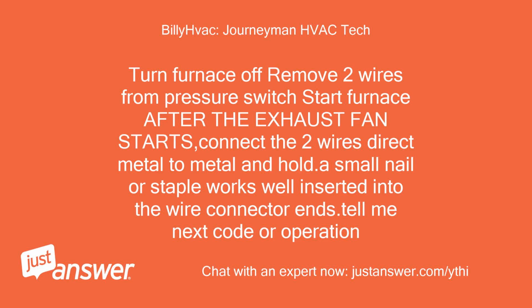Turn furnace off. Remove 2 wires from pressure switch. Start furnace after the exhaust fan starts. Connect the 2 wires direct metal to metal and hold. A small nail or staple works well. Insert it into the wire connector ends. Tell me next code or operation.